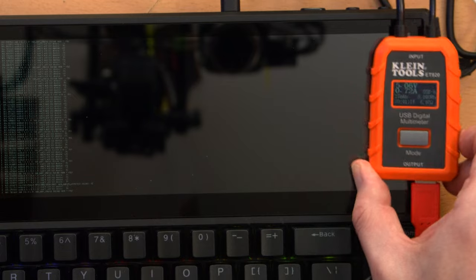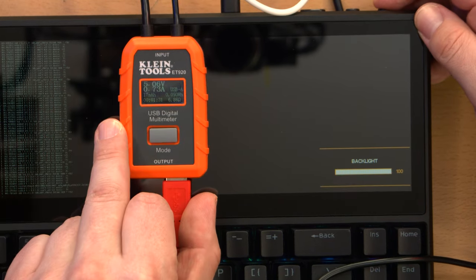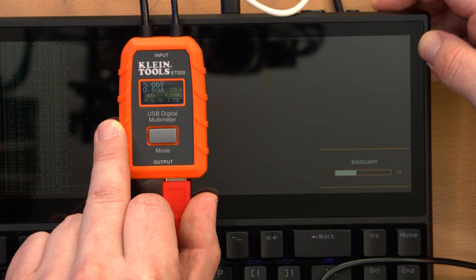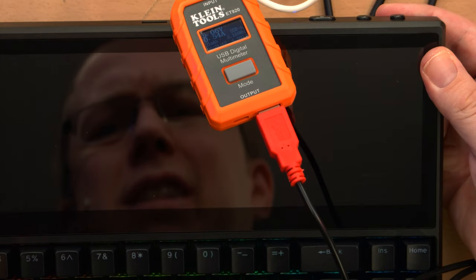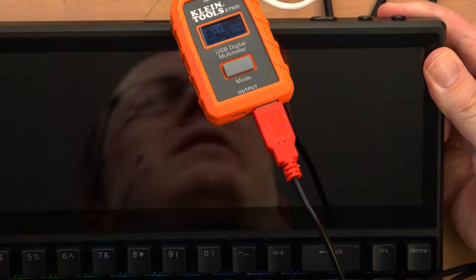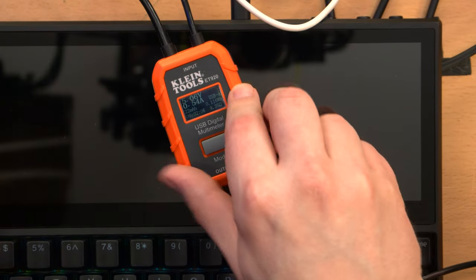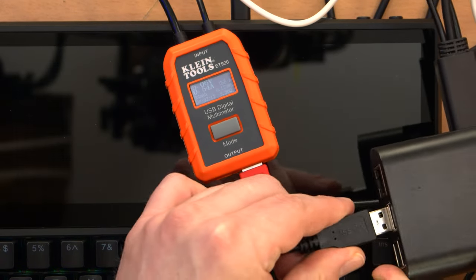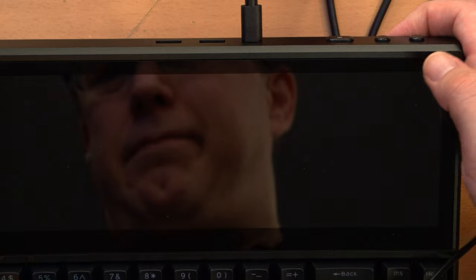With the screen mostly dark, it's drawing 710 to 720 milliamps, which is actually below its rated power — that's a good thing. Now let's see if I fiddle with the backlight how the power consumption changes. I'm going to bring it all the way down. The power consumption is definitely dropping — 600 milliamps, then at minimum backlight just about 540 milliamps. The backlight is barely visible in this lighting condition, but in a dark room that would probably be acceptable. And wondering if at that low backlight setting it can be powered off just the Raspberry Pi — yes, it can be.